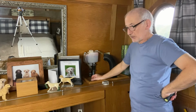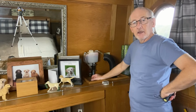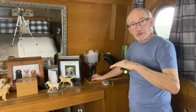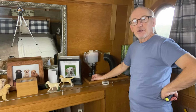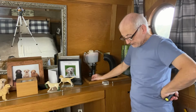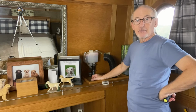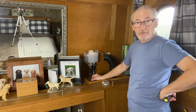So I released the air on the, there's a bleed valve on the back of the boiler, and quite a bit of air came out, which then obviously is replaced by water in the system. And I'm thinking, well, maybe the boiler had got a bit too much air in there, and I topped it back up and went to work. Came home, it had dropped an inch. So then I'm thinking, oh my God, I've got a leak on a joint somewhere.